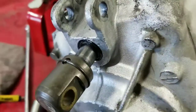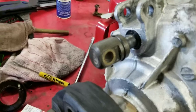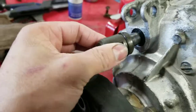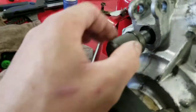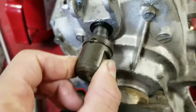Now I'm just gonna redo the clutch, put the clutch back in there — pilot bearing brand new, throwout bearing brand new — and then the transmission goes in and we're ready to roll. I also replaced the rear seal for the shifter linkage. This piece is usually really loose but I put a rubber hose from a fuel line inside it to make the shifter a lot stiffer. Let's see how that feels in the car.